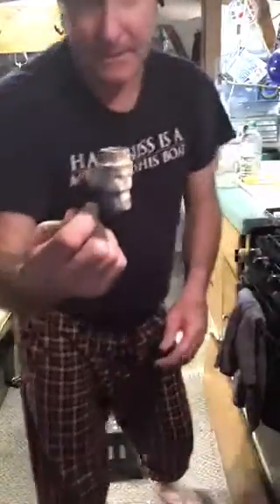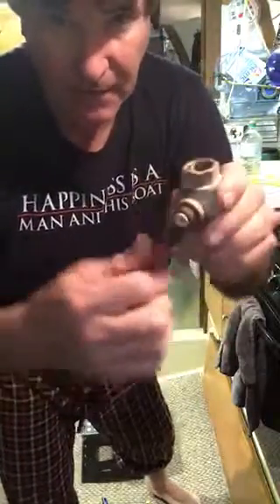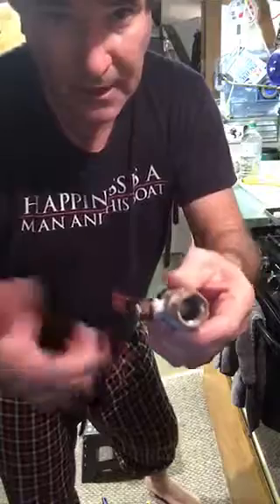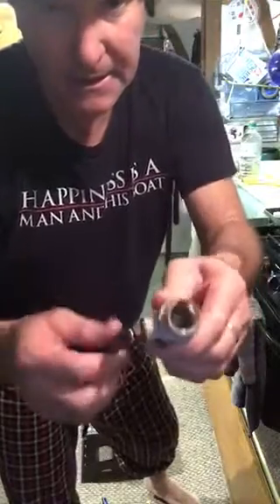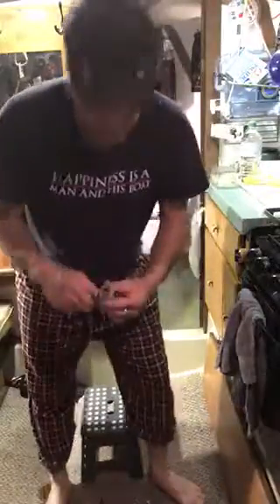This one I put in about seven years ago, and since I didn't work the valve, when I did finally work it I thought I'd better do this once in a while. It snapped and it's stuck in a half-open position. It didn't fail and it wasn't leaking, but I wasn't getting the water flow I needed for my toilet. So I swapped them out, and here's what you need to do.